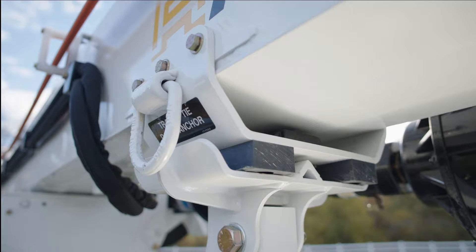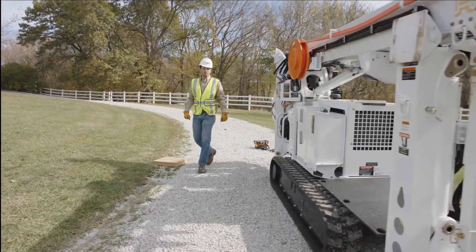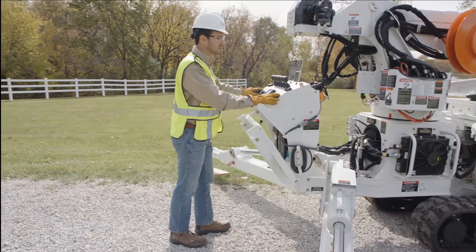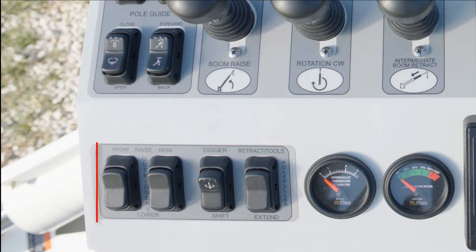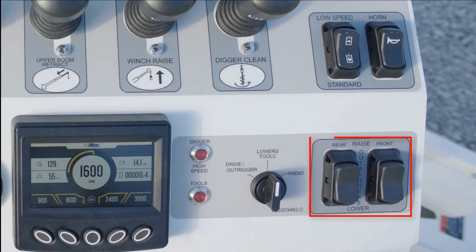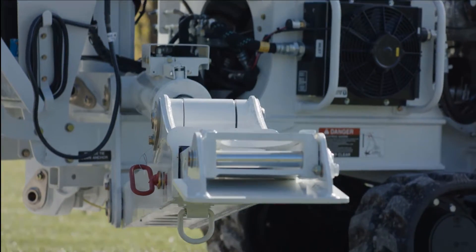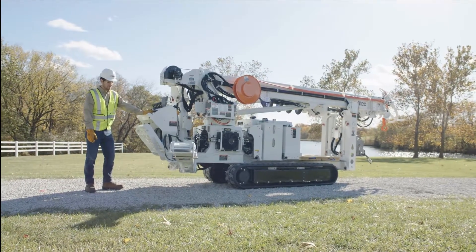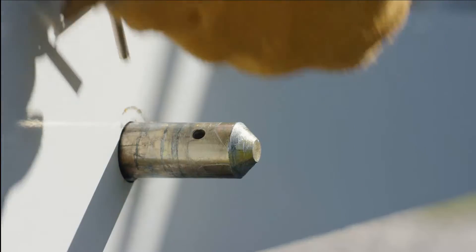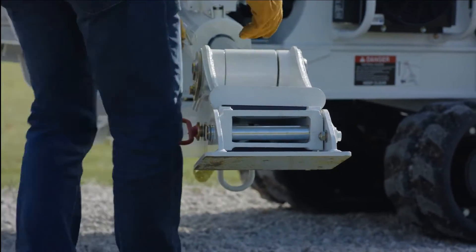If boom movement occurs, the interlock system is not functioning properly. To set the outriggers, move the control selector switch to the outrigger position. Step to the side of the unit and make sure no personnel or obstacles are in the way, then set your outriggers. The unit is equipped with four hydraulic outriggers, each with its own control switch. Operating the switch will either lower or raise the outrigger leg depending upon which direction you move the switch. As each outrigger is being lowered or raised, an alarm will sound to alert any personnel in the area that the outriggers are in motion. The outriggers can be lowered for additional clearance height when traveling. To accomplish this, lower the outrigger leg until it is horizontal, remove the pin and manually retract the leg to the inner pinning position, then install the pin and repeat for each outrigger leg.